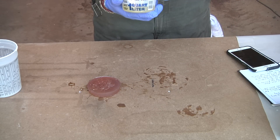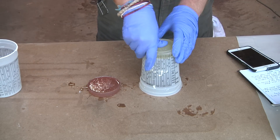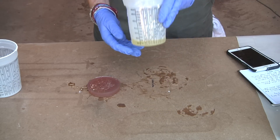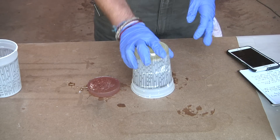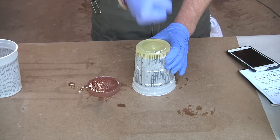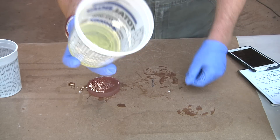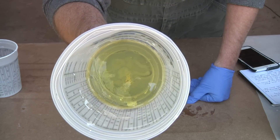On the left here is the cured polyester resin that we started this video off with — as you can see, it's got a purplish tint to it. And the stuff that's kicking my tail trying to get out of the bucket — this is the epoxy. For this particular batch I used the fast hardener. Fast hardeners, as I just mentioned, are typically more tinted than your slow hardeners. This particular stuff from Total Boat cures kind of like a Mountain Dew yellow.